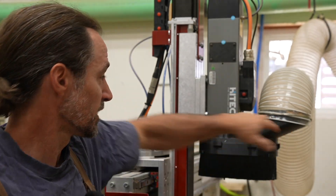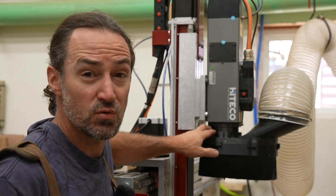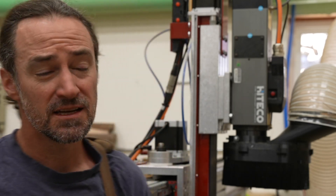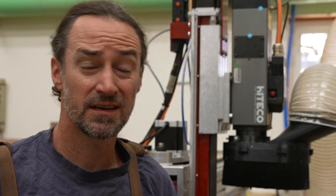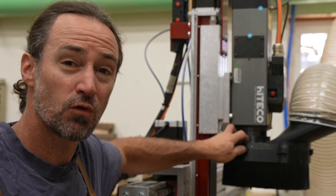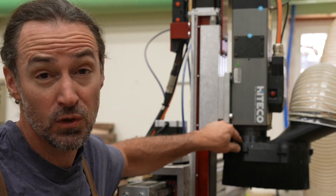One of the things I did change is eventually I did break my clamp. Over time just squishing it back and forth again and again broke it. But that type of problem is easy to solve in the 3D printing slicer software. I just decided to add more reinforcements in the area around the clamp, and so far that's been working pretty well.